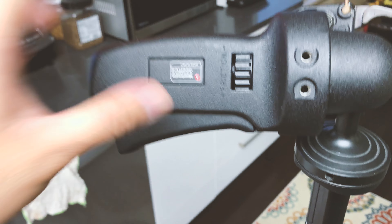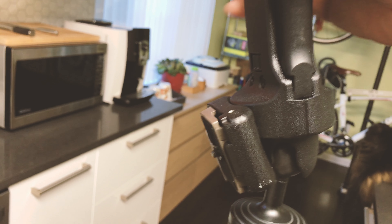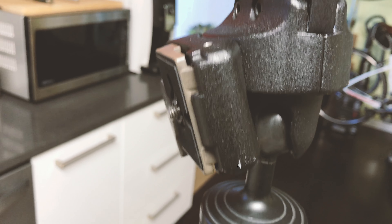If it's necessary to disassemble the pistol grip to clean it, it's not very hard. The only tough part when disassembling is there's a very strong spring inside. When you loosen the 4 screws and try to disassemble it, the spring and everything is going to pop out. When the spring pops out, you have to use a lot of force to push it back. Also, there's a locking pin — when you open the case, that locking pin has to be aligned nicely.